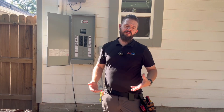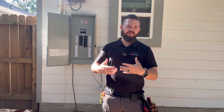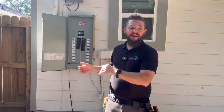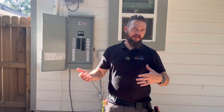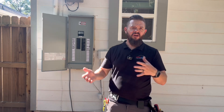Other than those items, the box is in pretty good shape. None of these are serious red flags. Probably the most serious item would be the breakers that are oversized for the wire — the reason that's a problem is because it will allow too much current to get to that wire and could essentially melt the wire, causing a fire. So we'd really like to see those changed out to 15-amp breakers where appropriate. There are scenarios where a higher breaker can go on a wire, usually involving refrigeration or AC equipment, but that's not what's going on here. Overall, as inspectors we're going to recommend that a licensed electrician come and evaluate the entire panel. We'll notate all of our specific items so the electrician can look at the report and see what they're working with. It just needs some work — somebody needs to come out and straighten out a few things. It's good that the electrical equipment has been upgraded, but there are still a few things that need to be done.